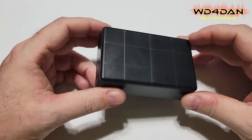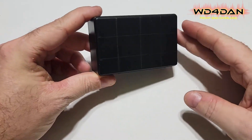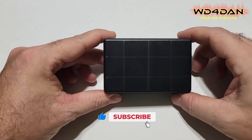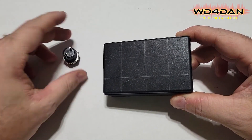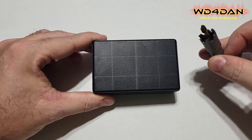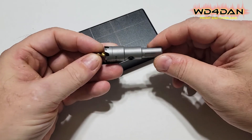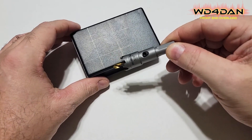Alright, obviously we've got to start off with a box. I've already taken the bottom off of the box and you want to lay out a grid pattern — get it in the light right here so maybe you can see the lines. I'm going to be putting six switches in this box, one at each of the line intersections. And these are the switches I'm going to be using, different colors. I'm going to drill the holes in this box with a hole saw made for plastic — this is 5/8 inch, and as always I'll link to everything in the description below.